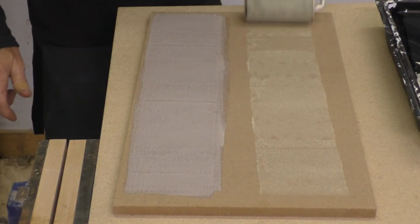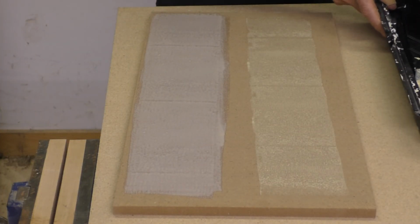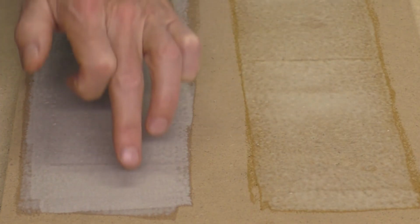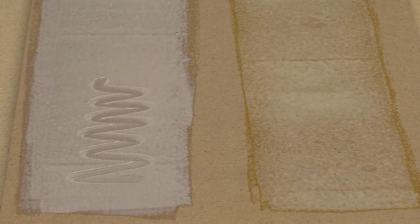Next would be open work time. Generally, when veneering a panel, you need extra time to spread the glue, especially on a large panel. All PVA glues have a relatively short open work time compared to urea resin, epoxy, and polyurethane glues. Some will start to tack in as little as a few minutes, and the most you'll get out of this type of glue is about 15 minutes, depending on temperature and humidity. Choose one that specifically mentions longer open work time.